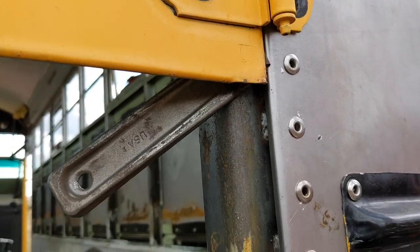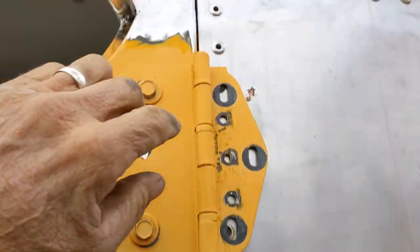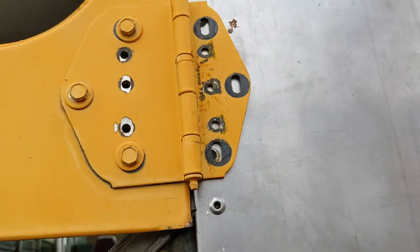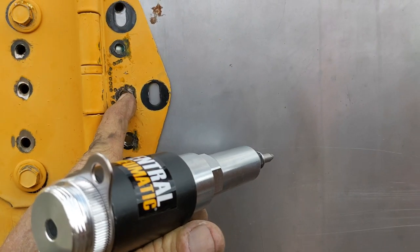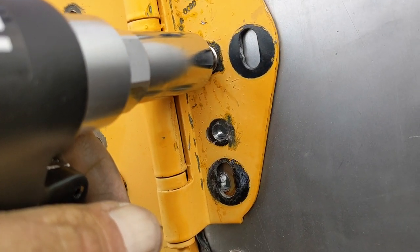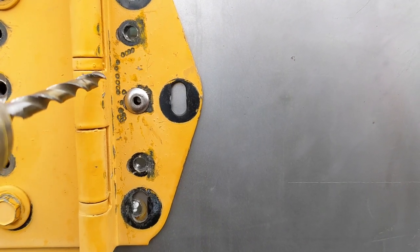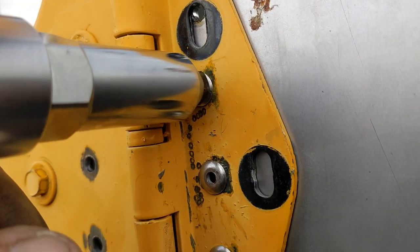The famous positioning wedges from an earlier video have returned for a supporting role. I had to pry this out a little bit so I can get the hinge out — since it's sitting here with weight on it and clamped over there, I want this hinge to sit flat, which means bringing the door out a little. Now I can drill through here and put in some rivets to anchor it temporarily. I've drilled this hole out to proper size; the other two are still slightly undersized so I can make sure snugging this up won't cause alignment issues. I'll drill those after I get this one tight. I've got one rivet that's slightly different — a more structural rivet with a thicker shank on the inside.